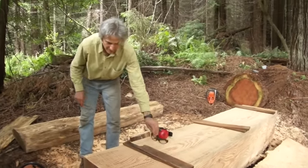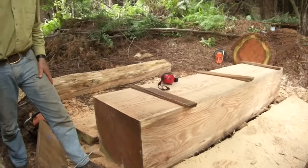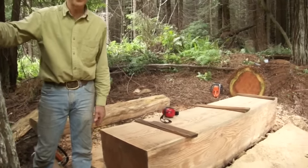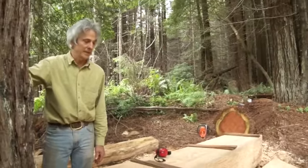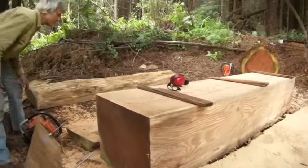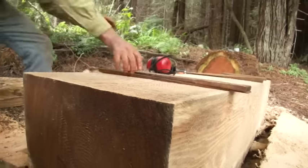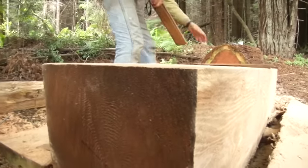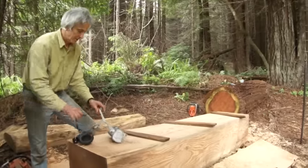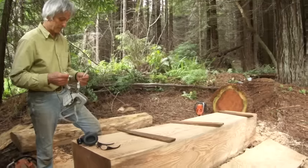Okay, now I can cut off of this flat surface that I've created for my next 4-inch slab. So you don't need your board anymore? Don't need the board. You only need it the first time. For the guide. For the first guide, yeah. Because now if you look at this, it's a really nice, straight and flat surface. Super plain. It planes. Yeah, lovely. Yeah. So if you look down there, that really planes now. Yeah, lovely. So you won't use these shingles until you're actually working along. You've just placed them ahead of you. Yeah, just get them in place.